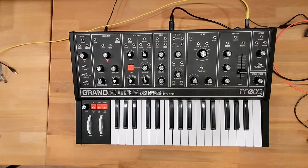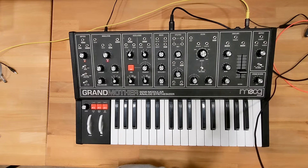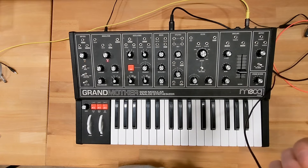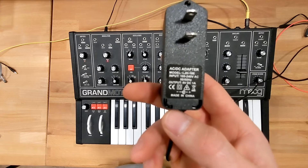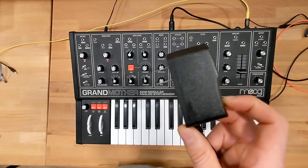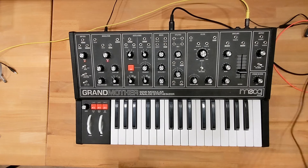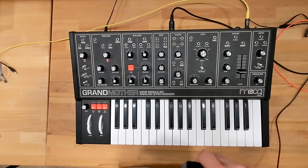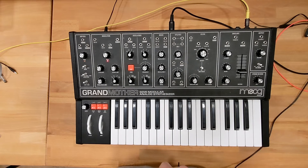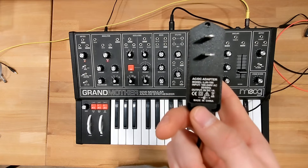The first thing I usually ask people to do when they message me for help with their MIDI Volts is send me a picture of their power adapter, because 95% of the time that's the cause of any weirdness people are experiencing. The power adapter has got to be a nine-volt DC adapter that's center positive. If it's not center positive, the MIDI Volts just won't turn on — the yellow LED will stay basically off. If you're using a DC adapter that's less than nine volts, you're going to get really weird results and weird scaling. Very first thing to check: make sure it's a nine-volt adapter and you should be good.